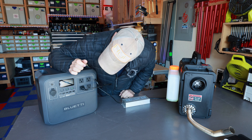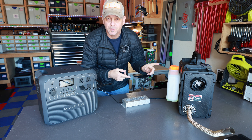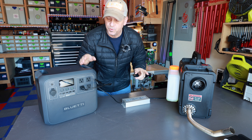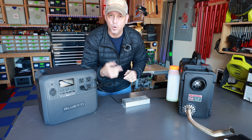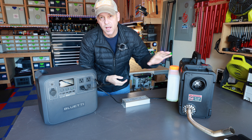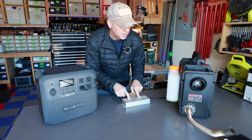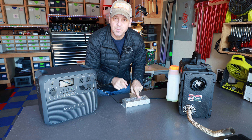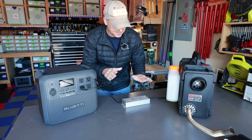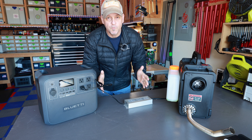That's some hot air. I'm going to let this heater run for about 30 minutes because I've had to stop and restart it about four times doing this test, and that's not really good for them. When you cut these heaters off, you do not want to disconnect from the power source because you want it to slowly cool itself down so it burns off all that nasty stuff inside. Otherwise you can clog up these diesel heaters and it's a mess. I'm going to call it — I think this is going to work. I probably will bring a 12-volt battery the first time just in case, but this is a lot easier to carry around than a 12-volt LiFePO4 battery.